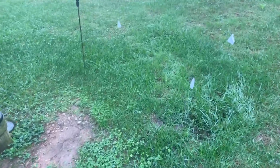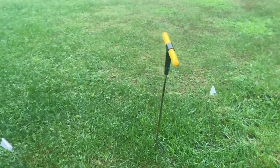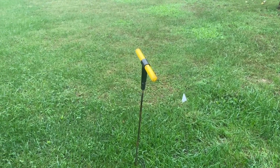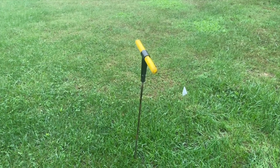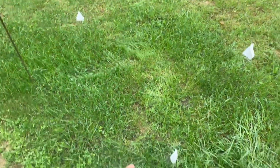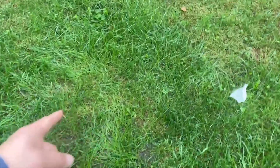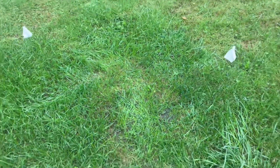When you're trying to figure out where the lid on a septic tank is, you're going to need a fancy probe like this one. This particular one's a T-probe — makes it super easy to probe into the ground and pull it back out. You could also use a grounding rod or a piece of rebar, whatever metal pole you want to stick into the ground to hit the edges of the tank. You go about eight feet from that pipe and then just start probing around. Where you see these flags, those are going to be the edges of the tank, and I'm trying to figure out where the edge points are so I know the lid is dead center — right here. Knowing where things like the lid is is very important, especially when dealing with problems like what we have today.